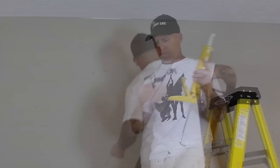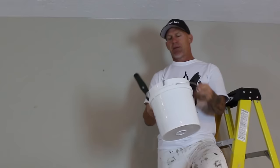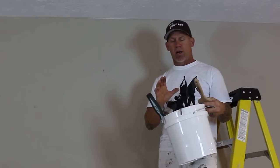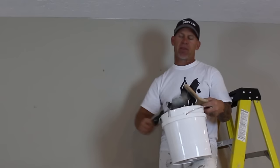Now I'm going to get to doing the cut-ins on the ceiling. I put a couple inches of paint in my bucket — not too high, not too low, just enough to work with. I'm going to get my roller all loaded up. I think it's really important that you back-brush your cut-ins. I'm going to get my brush full of paint — I like to dip my brush in, pat it on the side of my bucket to get it loaded up, and then I'm ready to paint.